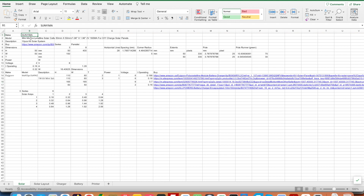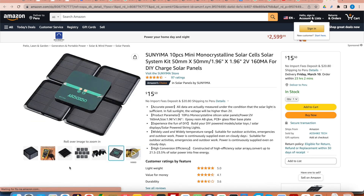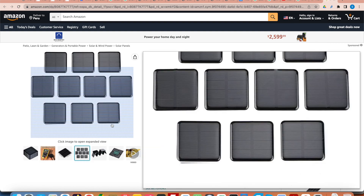It's a very small one, but very specifically because it's actually monocrystalline. It's 50 by 50 — quite small. What we want to do is integrate these into a bigger solar panel. Looking at the dimensions, I've reverse-engineered what they're going to look like and designed some clips to grab onto every single one of these and combine them into a panel.